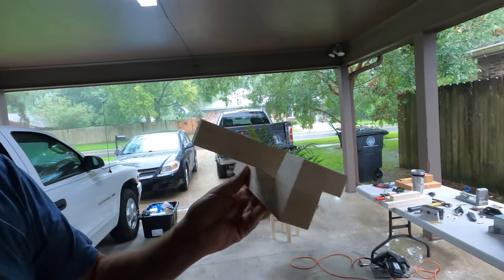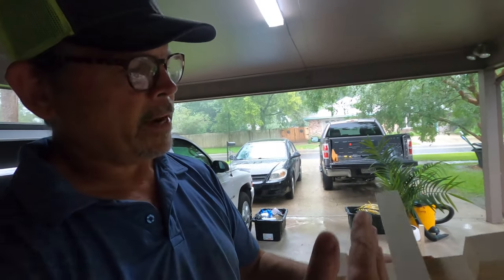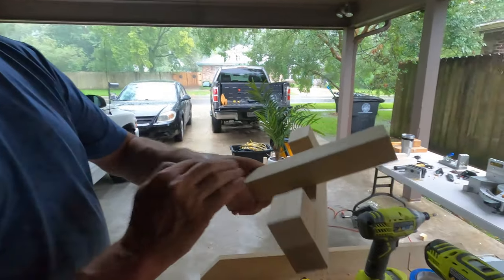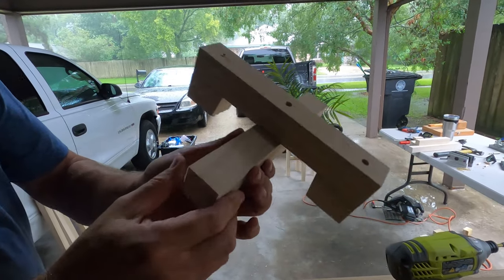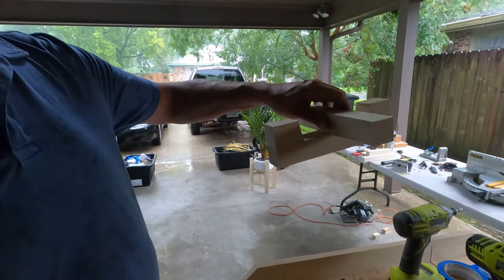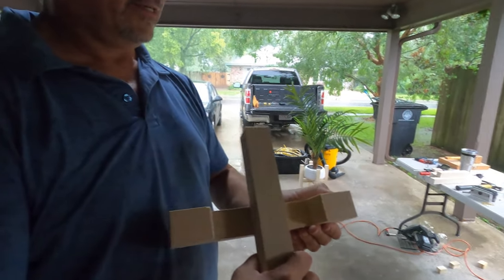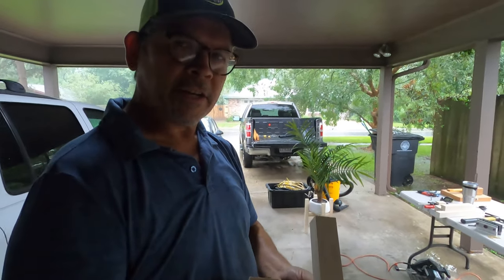So that's our alternate method to how to do it without a half lap joint. Just three screws. We made our own. This is called a full lap, where the boards just go by each other. That one's a half lap. Using the same method on that one, let's dowel this thing up and show them what it looks like when it's all finished.